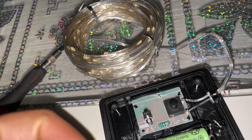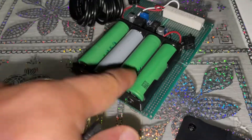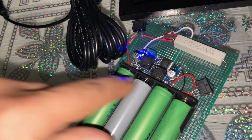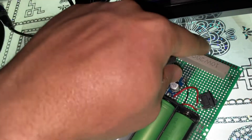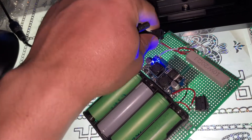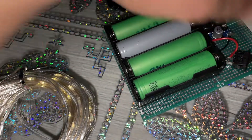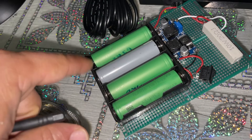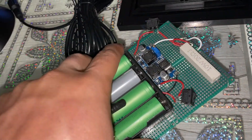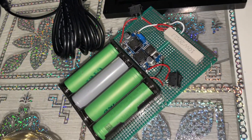One mode is always-on, which would probably be around three to four hours. It would have been cool to use 18650 batteries, but the compartment is a little too small. I also created this setup with a load resistor that boosts and drives a COB light — I have cells in series at a little more than 16 volts, stepped down to 12 volts, with the load resistor providing a constant one amp.